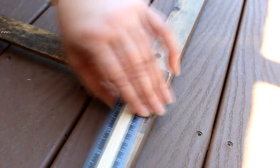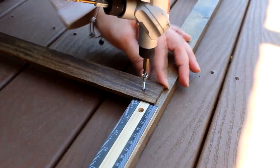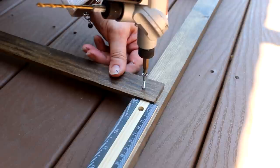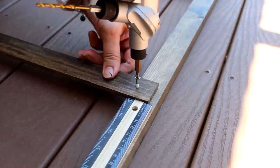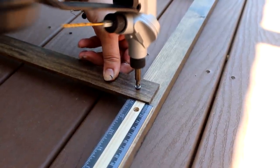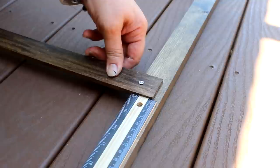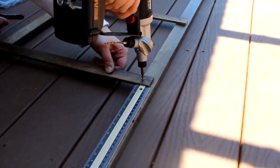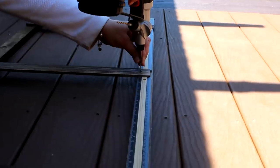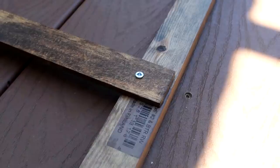However this is the only piece that will come out flush because you're bound to have variations in any hand-cut woods. To adjust for these variations I scoot down to the bottom of the ladder and apply the last rung next. I line up the ruler at the bottom of my pine board — as long as the edge of your ruler is square with the bottom of the pine board and your rung is square with the top of the ruler, you are good to go. That is going to leave a gap; your rung will not be flush with the edge. But that's fine — the ruler is machine cut, the rung is hand cut, so we've got to go with the machines. It's on the back so it really doesn't matter.